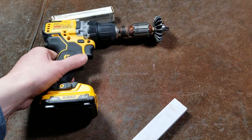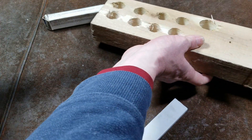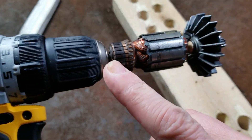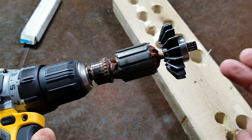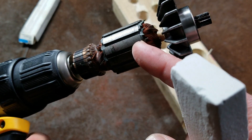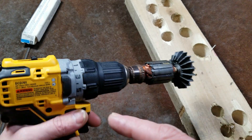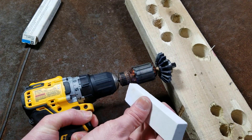In the situations I use it on, I'll just demonstrate it here. The big point of making this video is how you might restore these brush commutators if they're pretty dirty. One of the challenges is finding which end of the motor you can rotate on. On this one, the rear bearing happened to stay in the drill it was in, and the front bearing stayed on the motor, which made it very convenient. I'd recommend higher speed, and in this case I'm just going to run the motor like this.